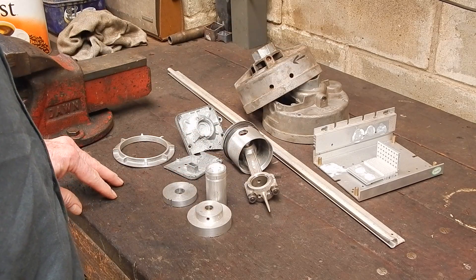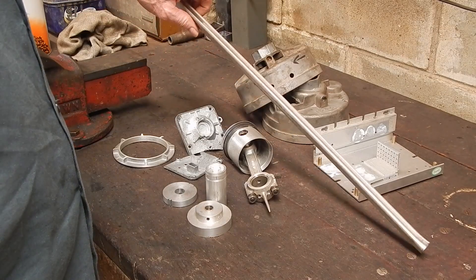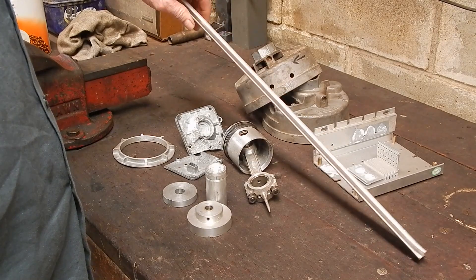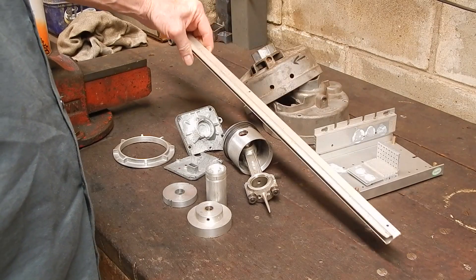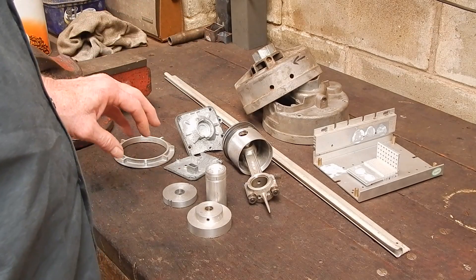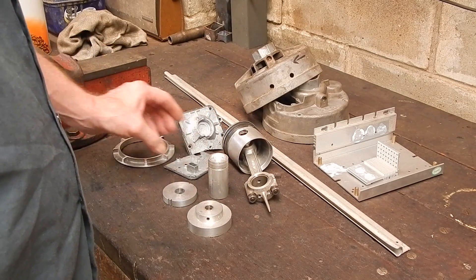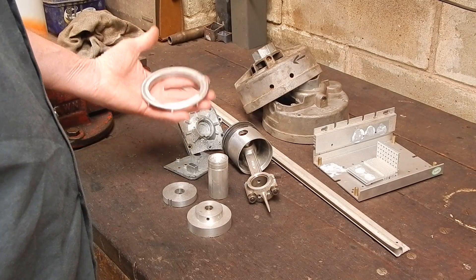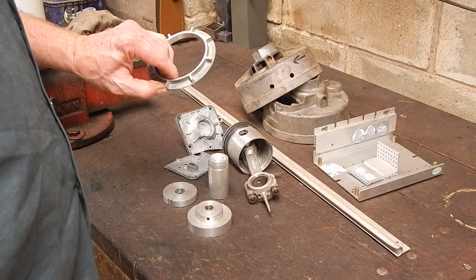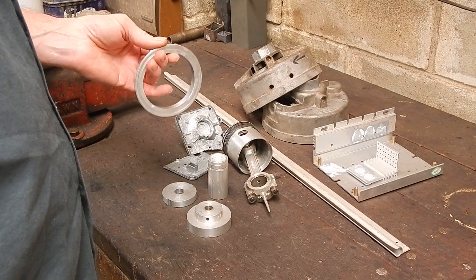I've got some samples here of commonly found aluminium. We'll start off with what you shouldn't use. Generally, extruded aluminium tends to be on the soft side. Some aluminium window frames can be hard, but a lot of extruded aluminium is soft and quite light. The weight of the aluminium, to a large degree, has some significance as an indicator of hardness. Here's some machine grade aluminium — that's fairly heavy for aluminium. Whereas here's some aluminium of unknown grade, and that's very light. That's aluminium I wouldn't use to make a gear — being light, it'll be invariably less dense, and there's a good chance it won't be as strong. It doesn't hold true right through, but it's an indicator you can use.